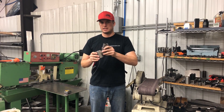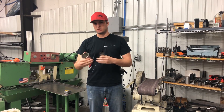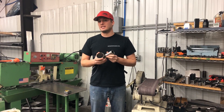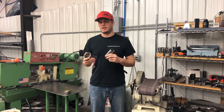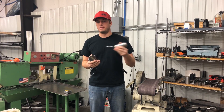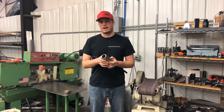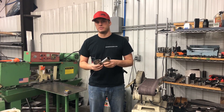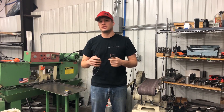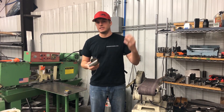What you don't realize is the stress — the heat, the vibrations, the expansion and contraction, plus things moving around in the engine bay — will eventually break that joint. Even something like if you don't have the wastegate properly supported going down the track, the weight of the wastegate bouncing will eventually crack it. Side note: one of the reasons I never wrap turbo piping unless I absolutely have to is that you'll never see the cracks in the piping. If it breaks and it's wrapped, it's going to take a lot longer to find the problem.